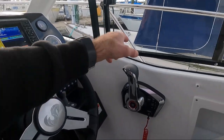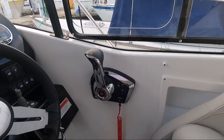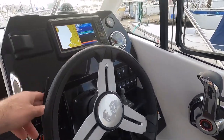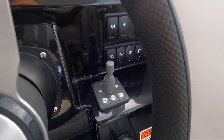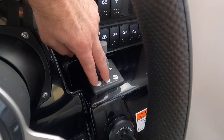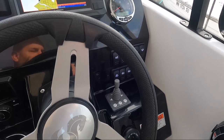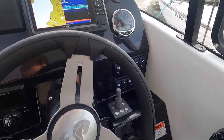Bringing you up to the helm — pretty straightforward, same general controls. There's a push-button release from neutral into forward or rear. There are additional features like active trim, which lets you set trim settings that automatically adjust, and a throttle-only option if you need to rev or warm the engine. There's a start-stop button for the engine, or you can simply turn the key, and of course your kill lanyard. This boat also has a bow thruster, which is a nice addition to the 7. To turn it on, push these two buttons until they light up with the key on — you'll hear a click at the front, and now you have a bow thruster to move the front of the boat side to side, port or starboard. This is not a device designed to park the boat for you, but it's a great supplement to your helm skills, giving you extra rotation without forward or rear motion.